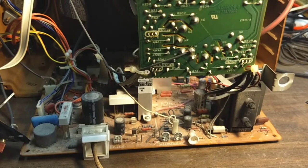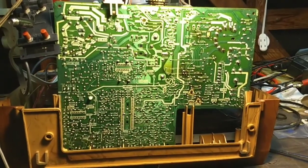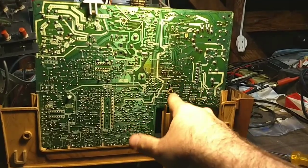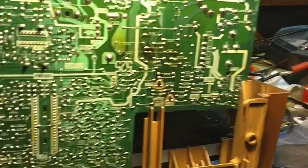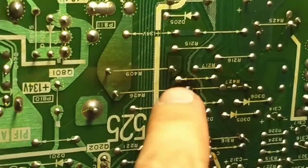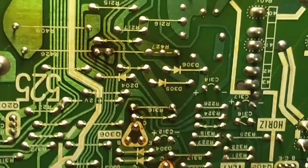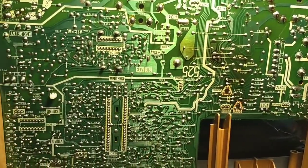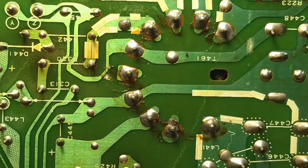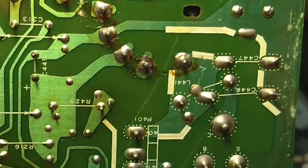Capacitors in the vertical output stage tend to go bad on these, however I did not see any signs of vertical deflection problems on this one, so we're going to forgo that. When looking at a circuit board, the very first thing you want to look for is discoloration. On this machine it's right around where the big power resistors and regulators are — you can see the darkened portions. The solder quality isn't great, and someone has already retouched some connections here. But there are more that still need attention, so we are going to go over this board and touch up the bad solders. Also look around the flyback — R320 and R442 both need resoldering, and it wouldn't hurt to redo the connections on the flyback transformer too.